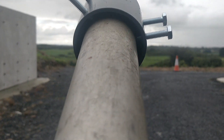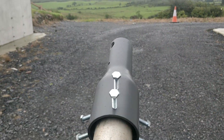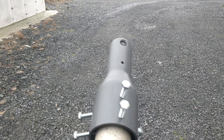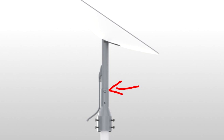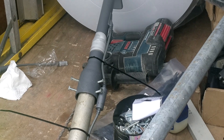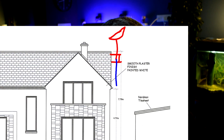Before heading up the ladder, here are three tips. First, these screws may rust over time, so we covered them with a little bit of grease after screwing them in, which helps protect against rain. Second, the Starlink SnapLock is not the tightest — you've probably noticed a small rattle on the regular tripod already. To prevent this, we used a little insulating tape around the SnapLock where it meets the dish, which minimizes rattle and also provides more water protection. Third, make sure your bar is long enough to go as high as you need, but also has equivalent length underneath the bracket to achieve a nice balance.